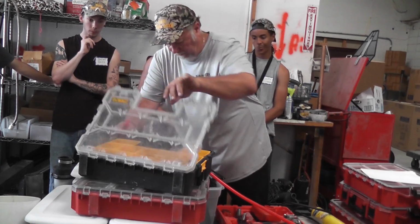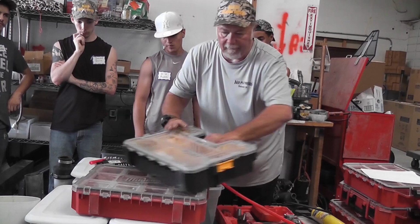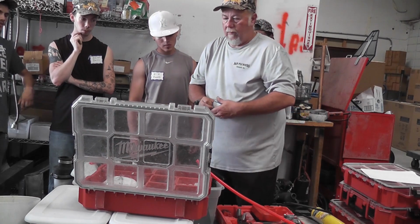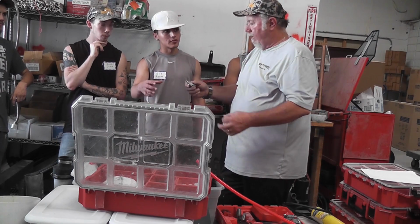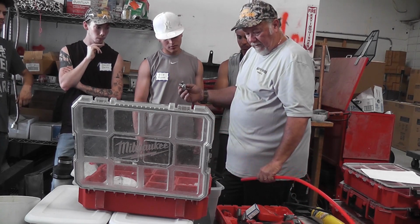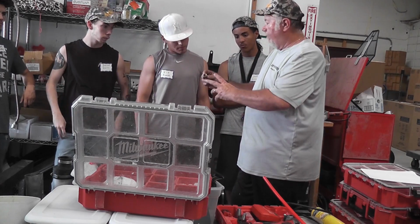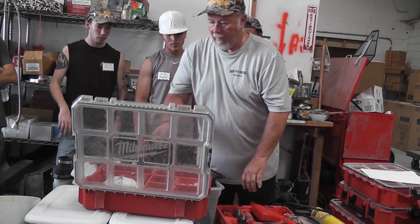Now the cool thing about it is, there's different fittings, of course, for every size. We go up to 2 inch. Let's say you got a piece of copper. Here's a hose. Same thing. Put your ring on there, expand it, pop that on there, and that's your shut-off supply, like under a sink or under a toilet. So that's an Uponor fitting. Same thing here. You've got an adapter, so you can adapt your copper to this. It slides in there and locks in. So that's Uponor.